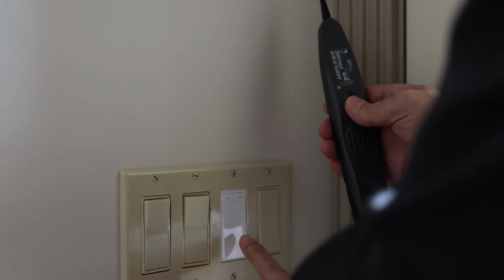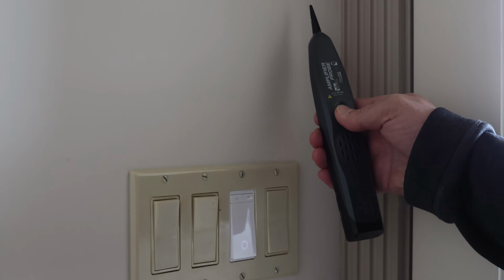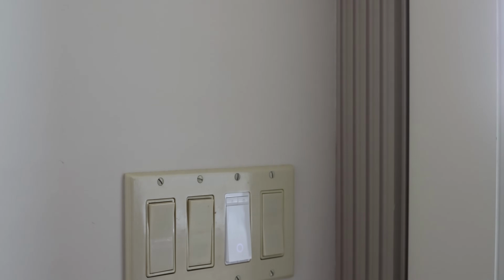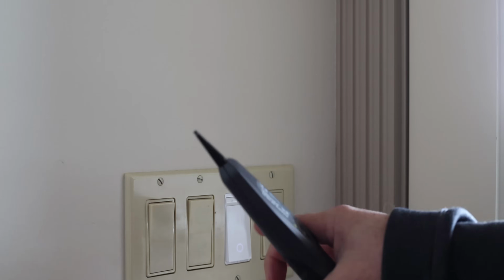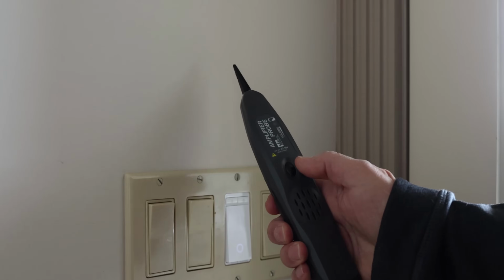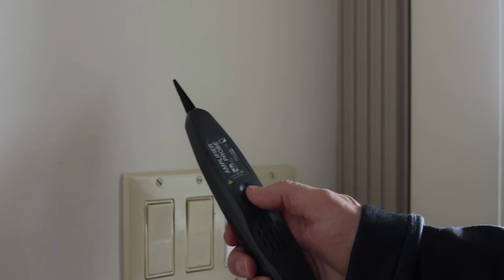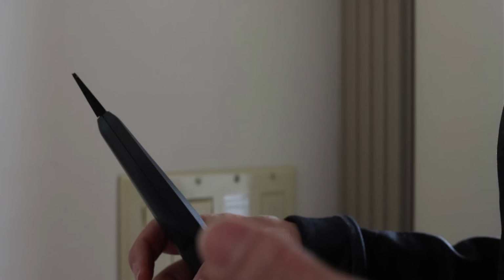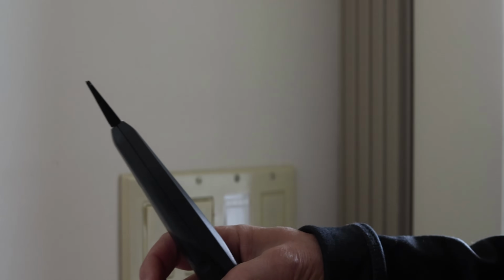And as soon as I turn it off, it goes back to normal. So this is what dimmer switches do for your line, not just the area, the entire line, the entire house actually. Now don't be alarmed, this is amplifying the noise probably like hundreds of times, and the noise may go into your amplifier, which still has some good filtering that could reject that noise, but nevertheless you don't want that kind of stuff in your line.